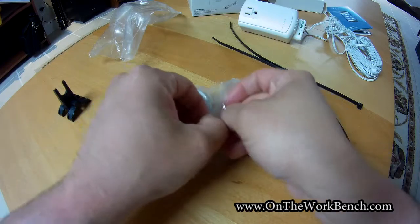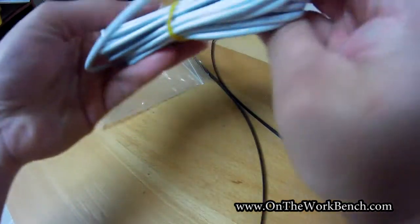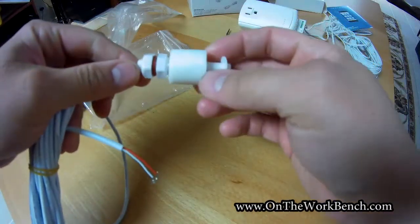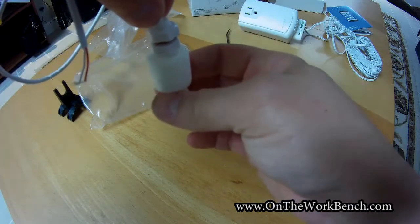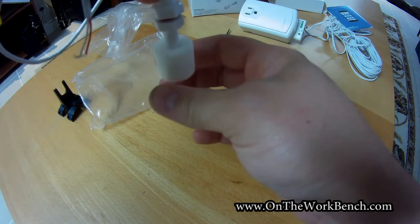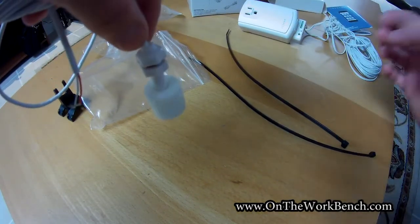On this we've got our lead — our red and our white wire — and then we've got our float that'll just go up and down. Whenever this float goes up, that'll trigger our sensor and tell us that our sump pump is working. So we'll set this up appropriately, and the next step is to actually wire this up.